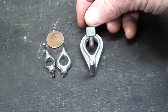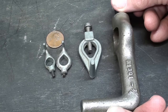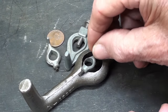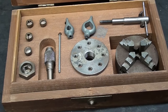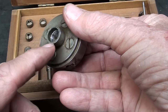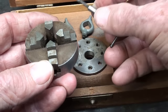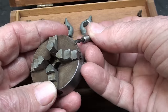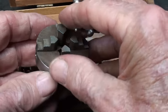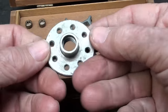Compare it to the penny. Now this is the other one that I just removed — looks massive, doesn't it? But yet nothing compared to this average three-quarter inch Armstrong-type lathe dog. Quite a difference. Let's see what's in the box. This, obviously, is a four-jaw chuck, and it has a threaded backing plate. Seven-sixteenths twenty is the thread. Reversible jaws, and this is the chuck key, which looks like a hex key mounted in a T-handle. And another face plate with threaded holes in it.